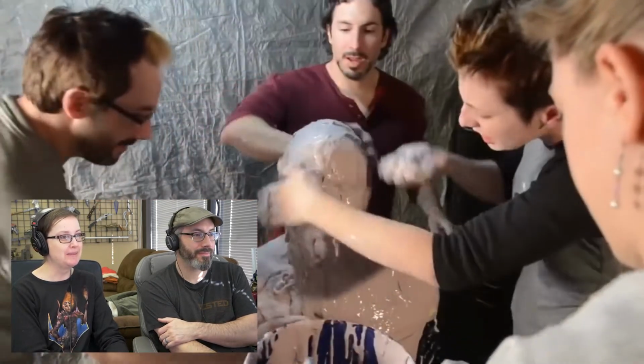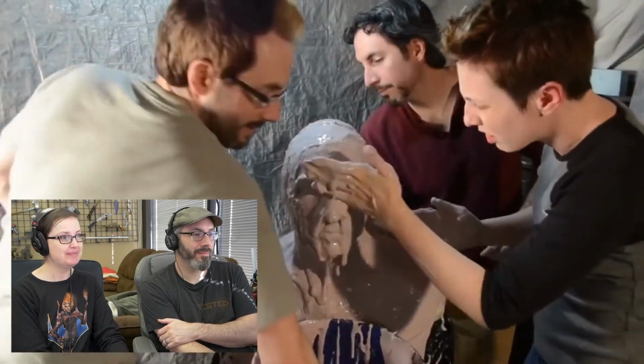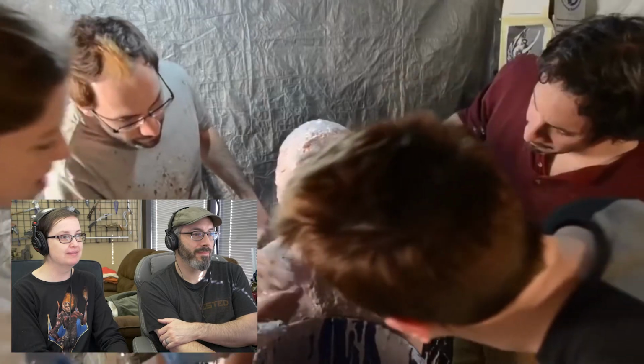Yeah, so he was getting really warm. What you'll end up doing is sort of pushing and smearing the alginate into all of the facial details to make sure you pick all of that up. You'll also be fighting gravity. This stuff will want to sort of slough off your model.